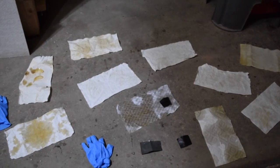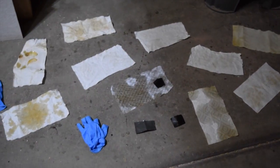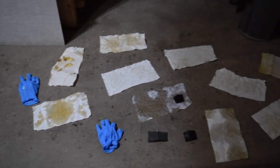I'll leave the rags like this for as long as a week. Usually on the day that my trash is picked up, I'll gather up all the rags — by this time they're usually dry — and then I'll stick them inside a Ziploc plastic bag, fill it with water, and put it in with my trash right before it gets picked up. And this has always worked for me as far as reducing the potential for a fire.